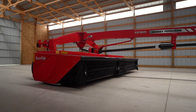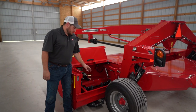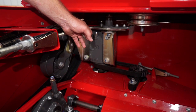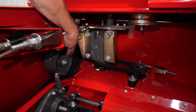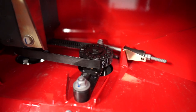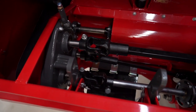Let me show you a few more of the robust components that we share with the flagship SP rotary headers. The heavy-duty right angle gearbox transmits the power from the main drive down to the conditioner roll drive belt and down to the cutter bed. We also use the same tension suspended cage drive as well as the triple spur gearbox for the conditioner roll drive.